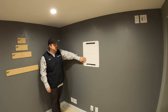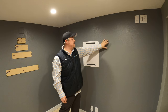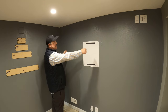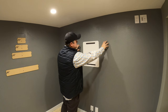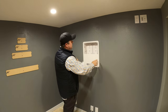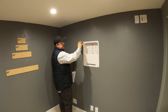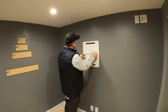Tyler Theater Design Co. What we're going to do today is a mock-up of a Samsung Frame TV install. The only thing we're not going to do is physically lift the TV — you'd need two people for a 75-inch. We're going to skip the wings lift and the one connect, since that's self-explanatory: one connect sits in the bracket with power, network cable, maybe an ARC adapter for audio speakers.